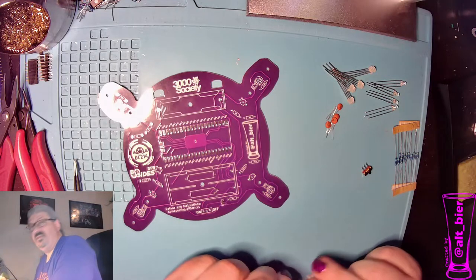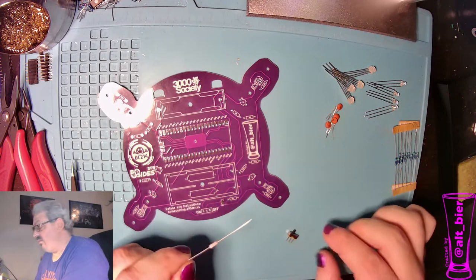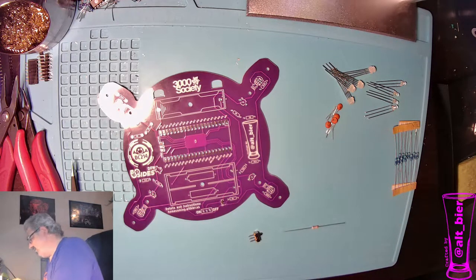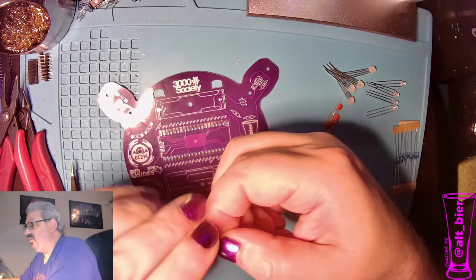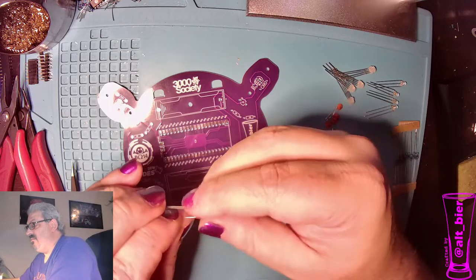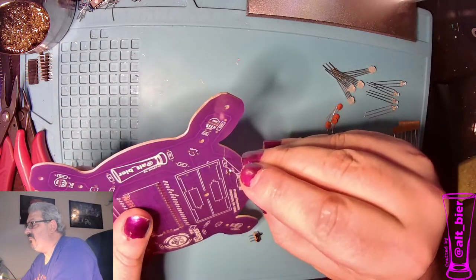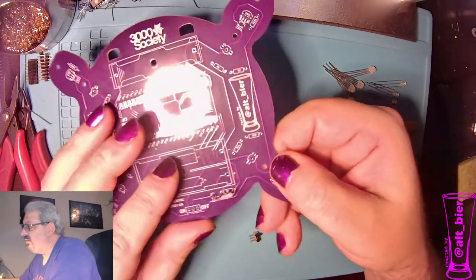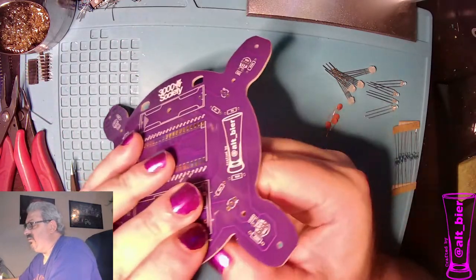There are two other pieces to the power protection circuit, and that's our 22k ohm resistor and the on-off switch. So we'll go ahead and finish this out by getting those on there. Now we want those to go on with the body of the unit on the back of the badge. And so this one goes right here in the place labeled R1.